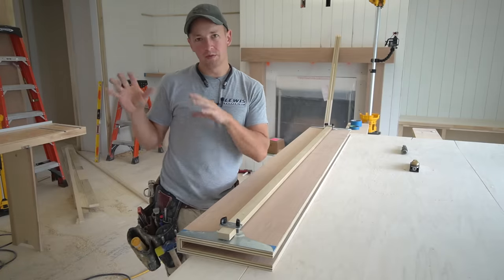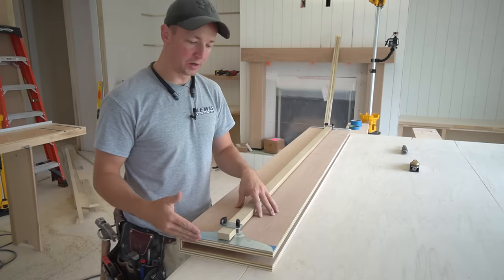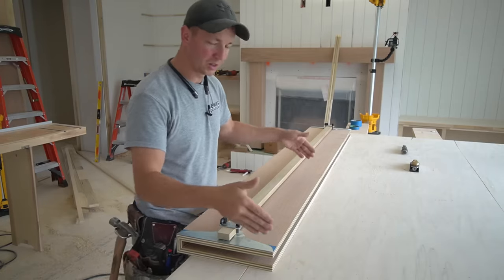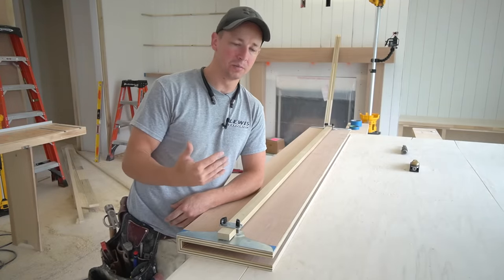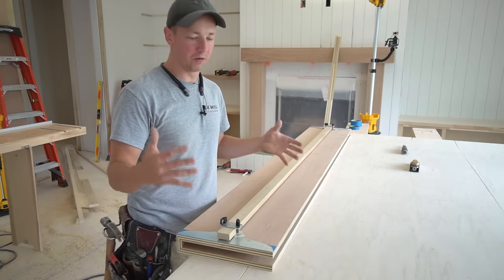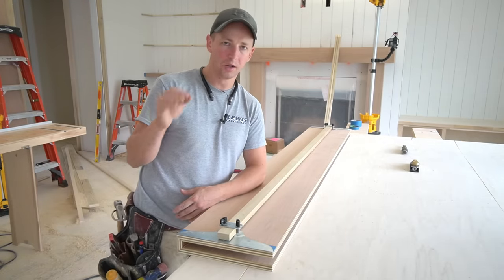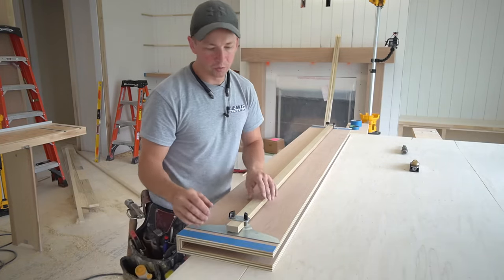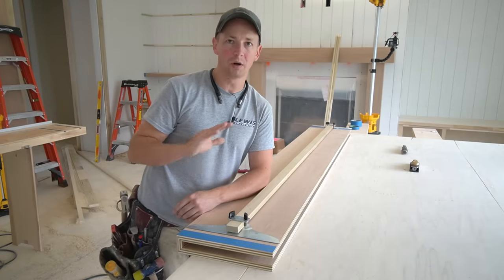You may have noticed that when cutting on the miter saw, I had a perfectly square cut at zero degrees here. What I actually did was slightly tilt that cut so the back of the shelf would be narrower than the front — that makes it way easier to slide into place. If you try to slide it in with two perfectly square cuts at the exact width, it's very difficult. The most important thing is I want my front edge as close to the exact width as possible for that visual of a nice tight cut. But if I have a little gap on the backside, I just caulk it, pull the tape off, and it looks like it grew together.